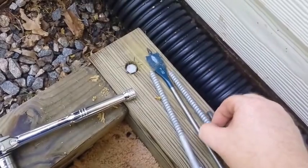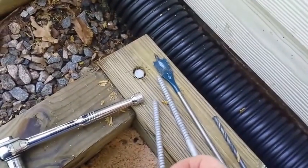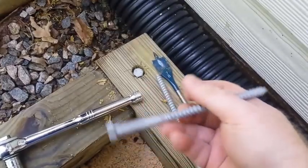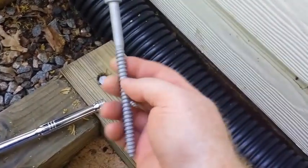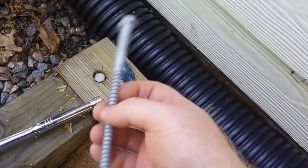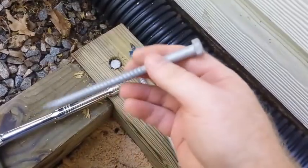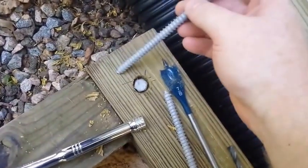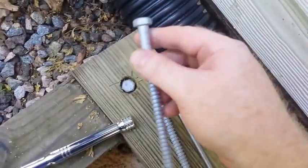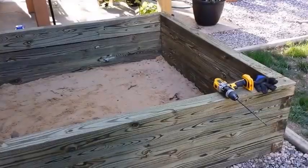So I used, this is pre-treated, or pressure-treated wood. So I had to use, I believe it's anodized, I guess that's where, what's the type of lag bolt we use? I don't know, anodized. Galvanized. Galvanized, that's what it is. Couldn't use the chrome-looking one, so I used galvanized. Otherwise, the pressure treatment chemical would chew through it. So anyway. Okay, pond update.